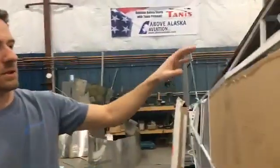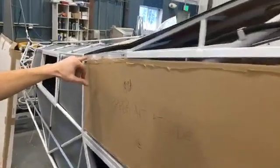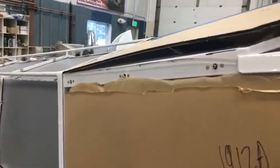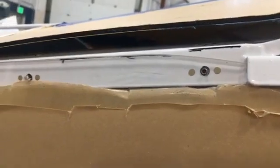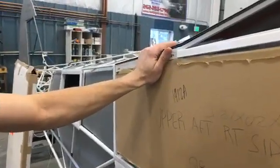and then to secure the glass in place, we rivet in nut plates, and we use special bits to drill through the glass. It's an unfluted bit, so it doesn't grab the glass. It actually just kind of burns through the glass. And then there'll be aluminum channels that we're custom fabricating that will secure that all in place.